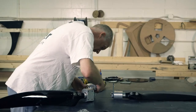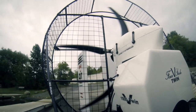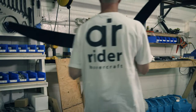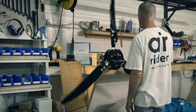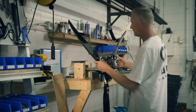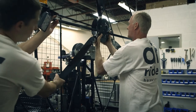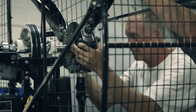The hovercraft is equipped with a variable pitch propeller system. Gimbals on every blade enable the propeller to pivot and rotate on its axis, giving the hovercraft the ability to brake and glide in reverse. Rotating the propeller on a spindle, the tech checks that all the blades are weighted exactly equally, adding a washer if a blade is even the tiniest bit out. A misaligned propeller will cause major vibrations when spinning at top speed. Once complete, the propeller is mounted in a cage to protect it from getting clogged with bits of debris.